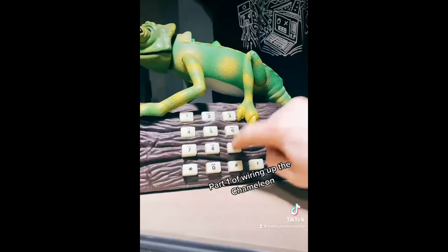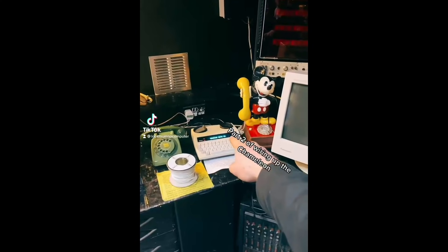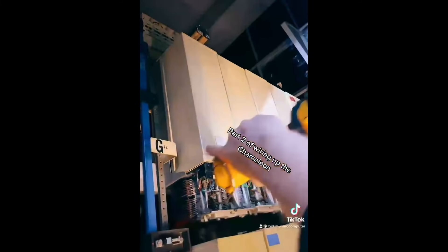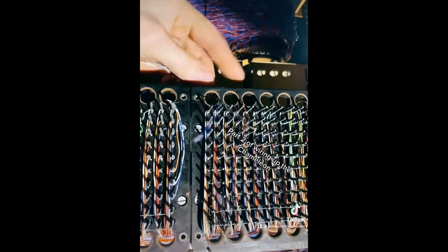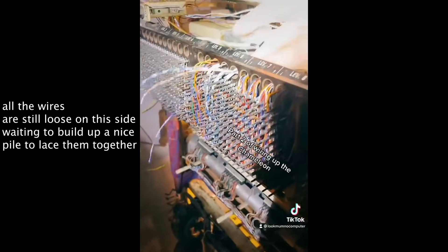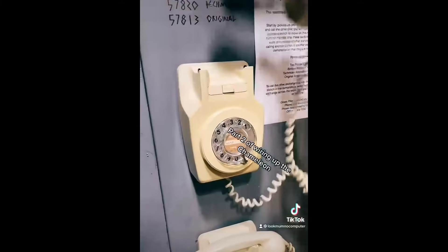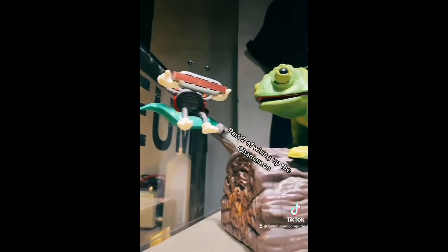In part one we managed to start wiring up the chameleon to all the telephones via the telephone exchange. The next job is to wire up to the final selectors — this is where we choose the last two numbers of the telephone number. I'm going to go for 81. We poke through three wires and wire wrap them onto the correct tags: plus, minus, and the P-wire. Then we route all the wires along and down to the subscriber levels, poke them through, and wire them on top of the original wires going to the chameleon. Remembering 81 is the last two numbers, you can now make the chameleon do the dance.